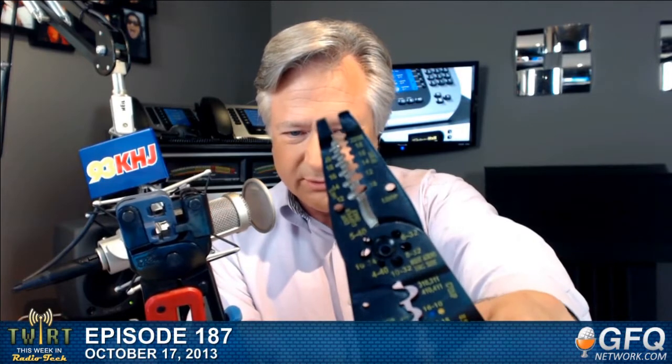And by the way, all I need usually to get this done, I think I got enough here, are these two tools. I use a stripper like this. There are all different kinds of wire strippers. I just happen to like this kind right here. I tend to be able to manipulate it pretty well. And an RJ crimper. This does cost some money, an RJ crimper like this, but you don't want to get the plastic kind that they sell at Radio Shack for $7. You really want to get a metal one that ratchets in.